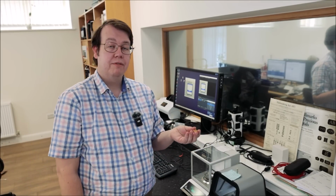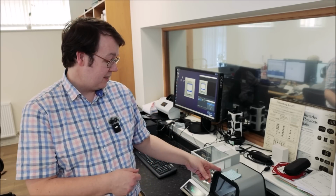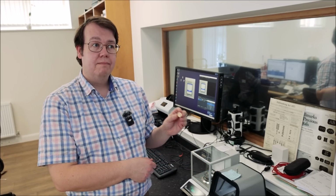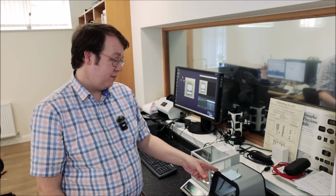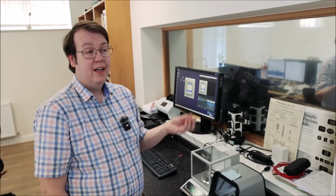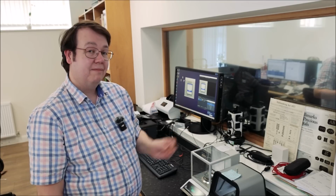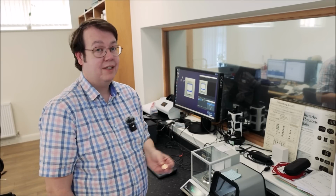First of all, the Sigma tester was testing that it didn't match the sovereign composition, which would make me suspicious in the first place. The Niton tester narrows it down though, it tells you that there's too much copper. Not enough gold, more copper than there should be, and you wouldn't get an accuracy like that. The most variation you'd normally get is, instead of 0.4 silver, you might get 1.5 for some older sovereigns from overseas. But that would come out of the copper, not out of the gold. The weight of it is fine, but weight isn't the easiest one to fake really for counterfeit sovereigns, so purely from the testers giving me the result of what content, it's a fake.